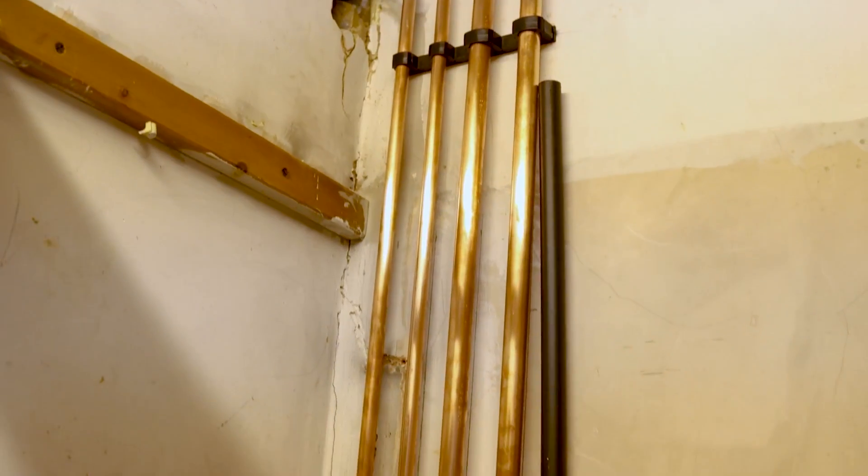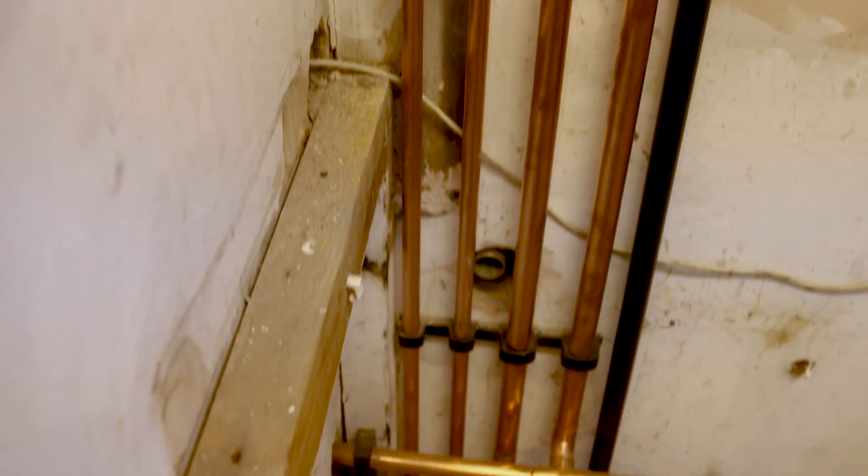Because this is going to be on a hybrid heat pump, we've had to improve the flow of the heating water. It was a really old system and wasn't going to be suitable for this new hybrid. So what we've done is re-piped all the circuits throughout the property, re-piped all the radiators, and we've even replaced all the radiators in the property as well.